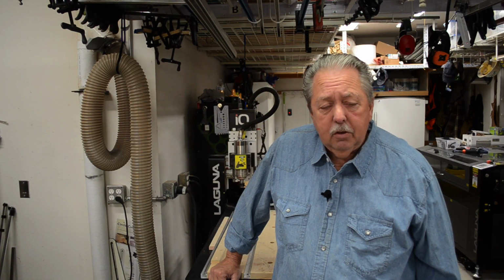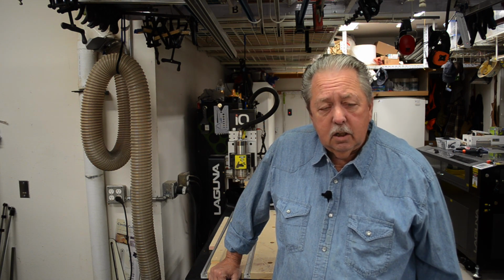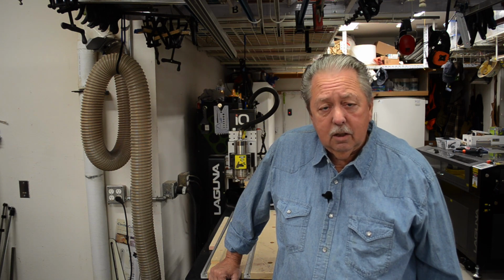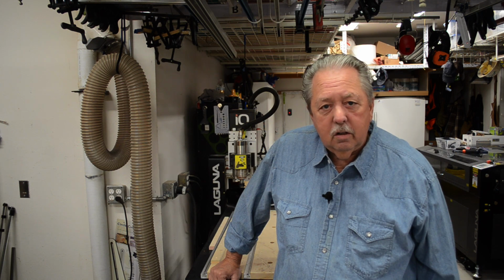So after I mount the cookie in this video and get it aligned and show you how I go about doing that through a series of tweaks back and forth, you'll get the drift when you watch the video. Then I talk about how I actually mount a sled, because I use a sled to put the cookie, the thing I'm carving, onto the CNC and mount it to the CNC. And then I use dowel alignment holes to make sure I get it back on the exact location every time. Once I have all that done, then I do a quick demonstration of how I surface this cookie. With that, let's go ahead and get started in the video.